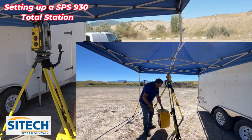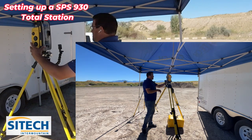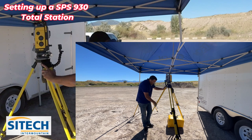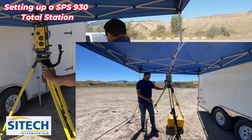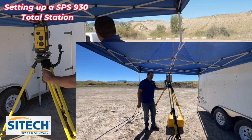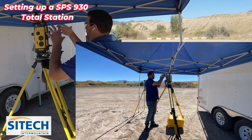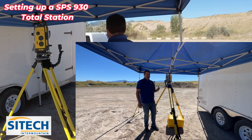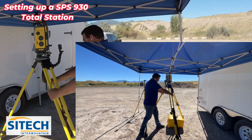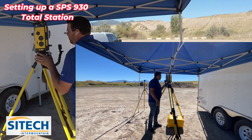We're not going to use the battery pack for this session — just the single that's in there. I always take my gun case, the total station case, and lay it down because if you get a gust of wind, it's going to blow over. Now keep in mind, if it's so windy that you're afraid it's going to blow over, yes, you can put some sandbags on the bottom. But if you're taking it as far as having to bolt this thing to the ground, the total station really shouldn't be out in that wind, because the wind is just going to be fighting you. Once you're good here, I like to go really hard on the legs and take out any possible slip that there might be. Check the bubble one more time.